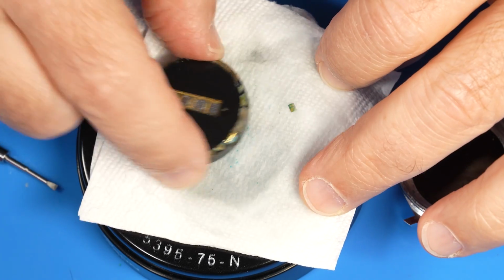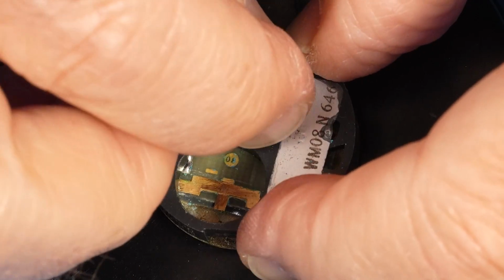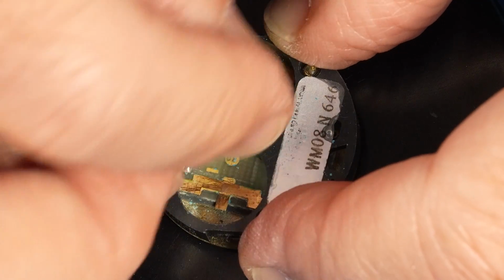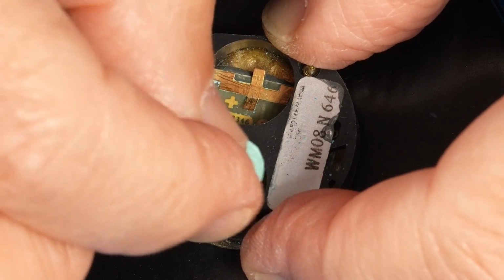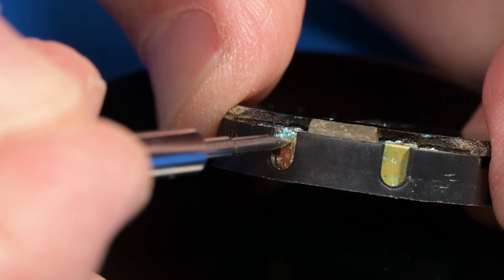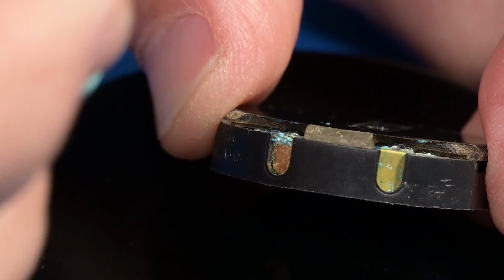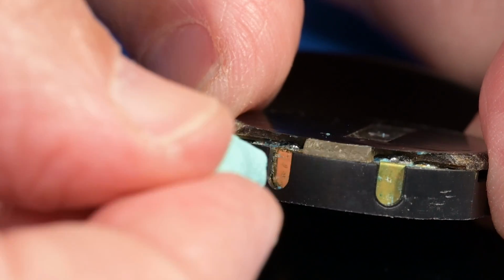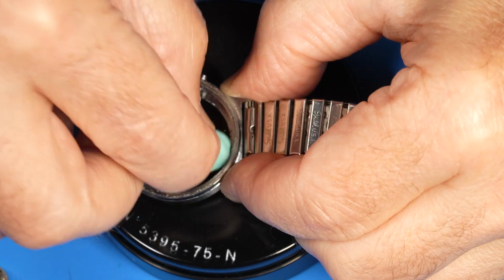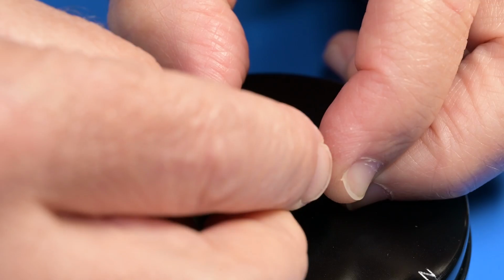When these batteries ran out, I'll bet the watch was put in a drawer and forgotten about. The only sure way to prevent batteries from bursting in your electronics is to remove them, which is a rather impractical proposition, so the risk of purchasing a forgotten electronic watch where the batteries have gone bad is high. After loosening them, I'm picking up the biggest corrosion crumbs with a piece of Rodico, that green watchmaking putty.